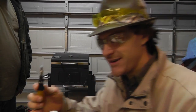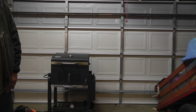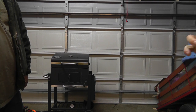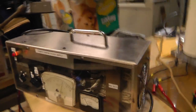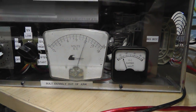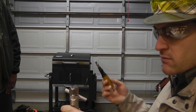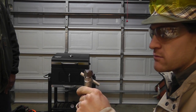You ready? Now I'm going to let it blow out a little bit. Put it on 200 amp even though it's not putting out 200 amp — while this is pushing through this hose I'll show you what we're running at. So 25 amp, 12 volt. Earlier I had it on 12 volt high and it was slightly lower, about 11 volt. No flashback — I'm burning. No, it's still burning.